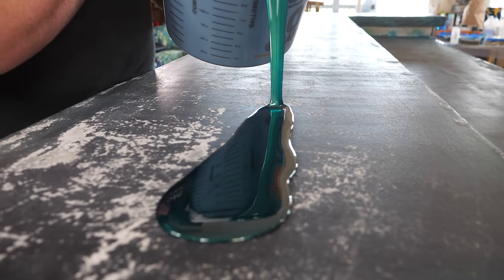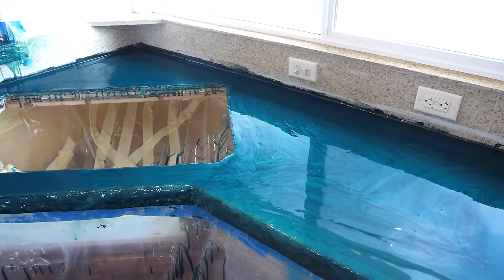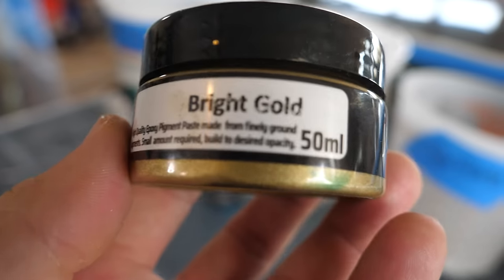After a thorough cleaning, bonding primer, and a concrete overlay, we got the counters leveled and joints hidden, a nice thick rock face edge polished out, paint in a green seal coat to cure overnight. And today is the day to color the world.